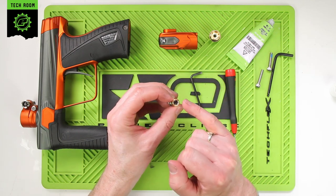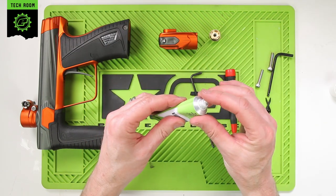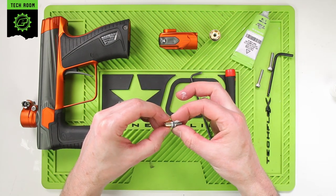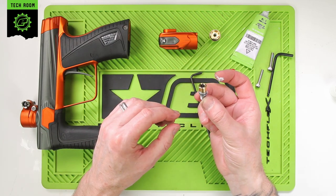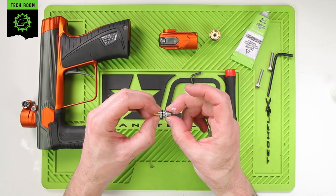What you don't want to do is get any grease on the face of the regulator seal, as that will affect the performance of the regulator. But you are going to need a small amount just on the o-ring on the outside. This piece doesn't move up and down during the function of the regulator — it only moves as you adjust it — so it doesn't need a lot of grease on there.